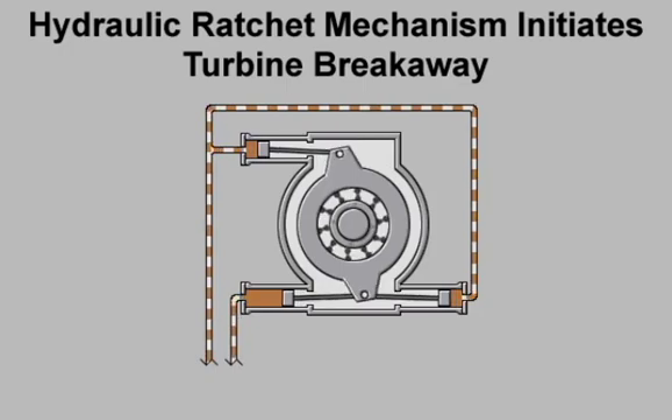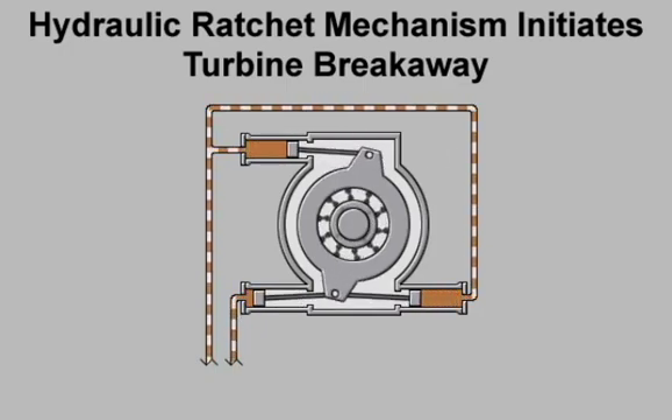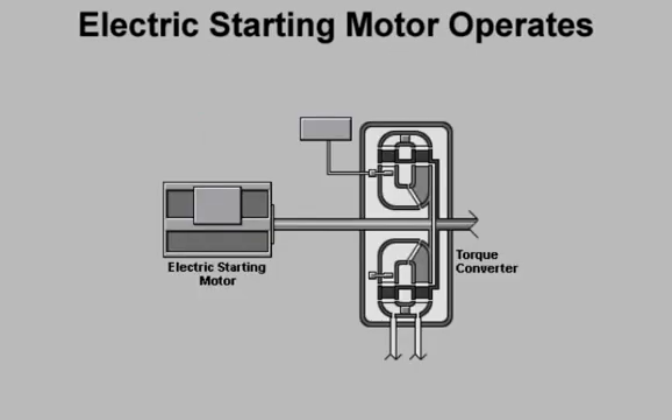This provides sufficient torque to overcome the static friction in the turbine and to break away the turbine rotor. The starting motor is then turned on and the torque converter fills with lube oil. Power is transferred from the motor-driven impeller to the turbine wheels and the output shaft of the torque converter, forcing the gas turbine rotor to begin turning at a few rpm.